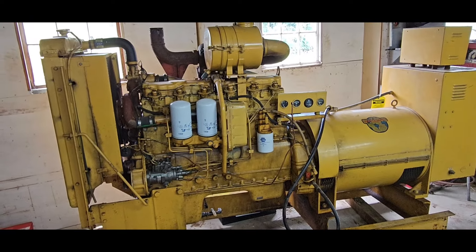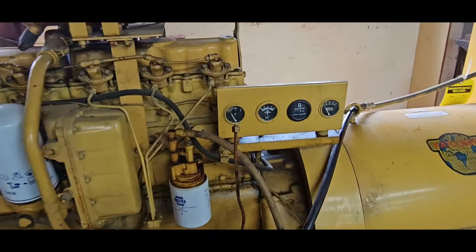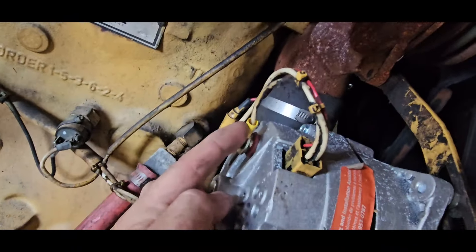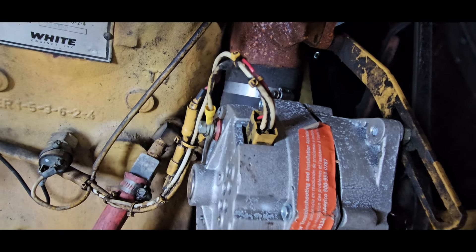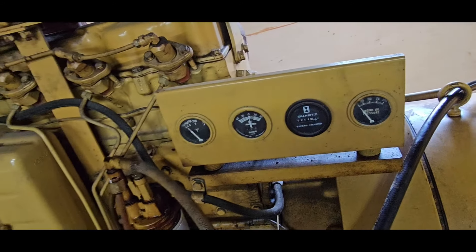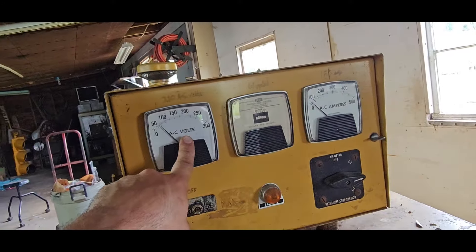Alright, well it's back in the garage here. We put it outside just to run it so it didn't smoke up the garage. But yeah, it runs great. It came up to temperature. We also fixed an issue where this white wire here wasn't connected, which caused it to shut down on a fault because it wasn't sensing any voltage off the alternator. We put that back on, ran it for probably 20 minutes, and it didn't shut off. Had really good oil pressure. Tested the outputs — we got 208 three-phase and it read correctly on the display. So yeah, we're good to go.